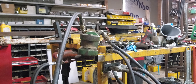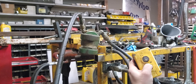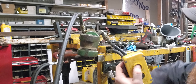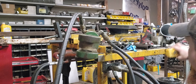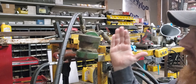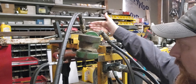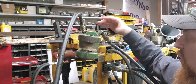You'll see here the cylinder works just fine — it'll pull itself in, no problem at all, and pushes itself back out. We're going to extend it all the way out, then pull it back in, and now watch what happens when I close this valve right here. What's happening is that fluid is actually bypassing over the piston and pressurizing the back side. Because you've got more surface area on the back side of that piston, it'll actually force itself outward — even though you're pressurizing the retract side, the back side overcomes the incoming fluid.